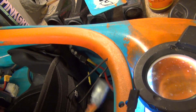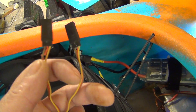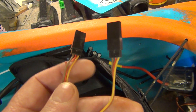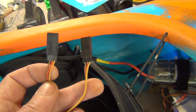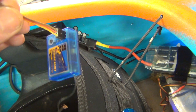Both ESCs go to a Y-harness. I've grabbed a few to show you what a Y-harness looks like — it's both your ESCs. Please ignore that cut wire, because with the Flyers you don't cut the wires. There's no BEC to power anything coming off those, and for some reason they need the signal — the red wire must be needed because they won't work unless you leave them uncut. Both ESCs get one wire into the Y-harness, and the ESC signal just goes into your receiver.